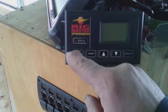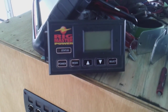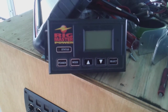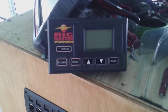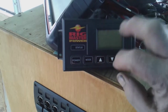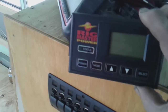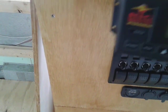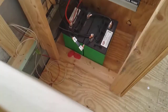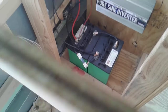What this thing here is, is a big rig APU control unit. If you've ever noticed the big rigs parked at night with that little diesel engine running — that's called an APU, auxiliary power unit, and it runs heat and air conditioning. We had a bad control unit and I saved the case, gutted everything and made it fit my meter, so it has a nice clean box. I'm going to get that wired in. The shiny piece on the ground is called a shunt, and that is what's needed to make the meter work properly.